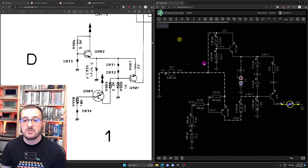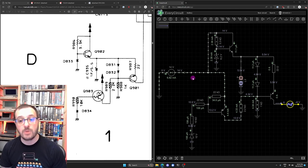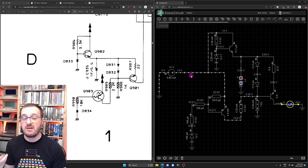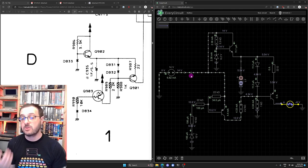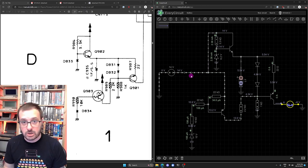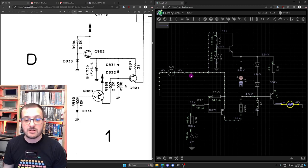Now, what happens when we turn the system off? So the theory with the supercapacitor is that 1 farad holds that charge for a very long time. They're commonly used as backup capacitors or like temporary batteries almost. I know the original Xbox uses a 1 farad supercapacitor to keep the real-time clock alive when you've got it unplugged for a decent amount of time.